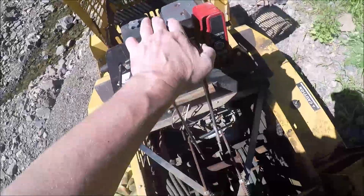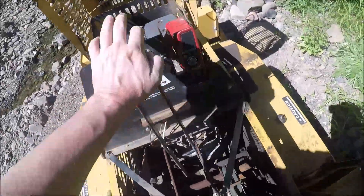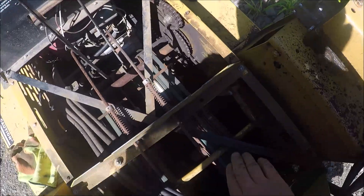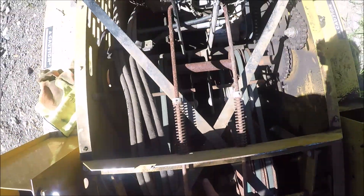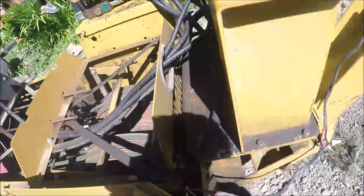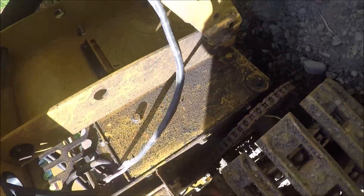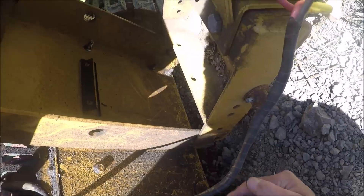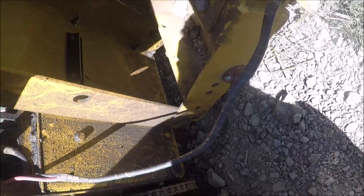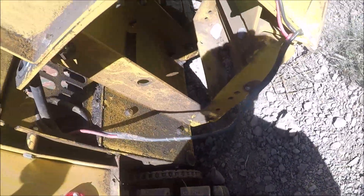Anyway, when you're doing forward and reverse, you're yanking on this sucker — it doesn't hurt a darn thing. The two drive shafts are separate, so you can run your individual axles. They come down here to a very small sprocket, down to a larger sprocket, which gives you a lot more power for your RPMs, and then they drive your tracks in these large sprockets out here.